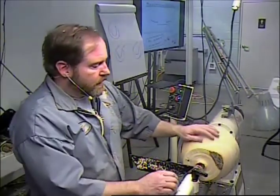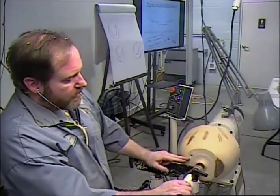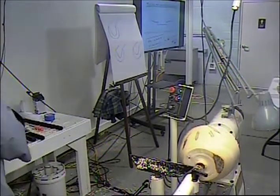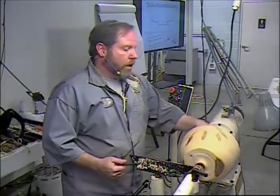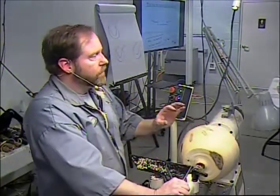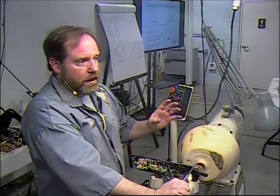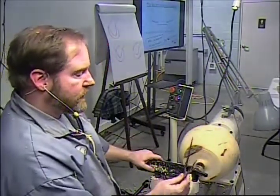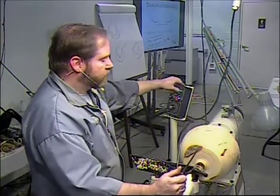To do this, we need to determine what size our tenon needs to be. So I know that my chuck jaws can go to 4.5 inch, which for a bowl this size is going to leave me enough wood to make an appropriate sized foot when we're all done. So I've got my dividers set out for 4.5.